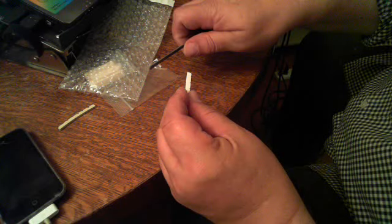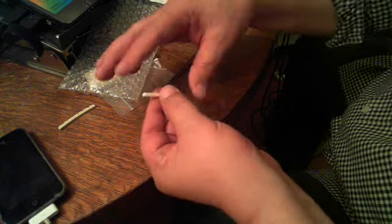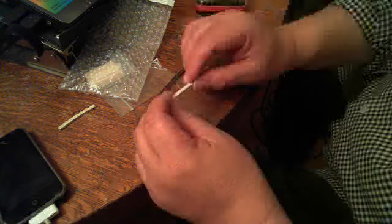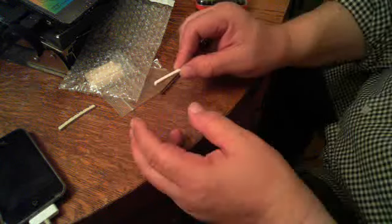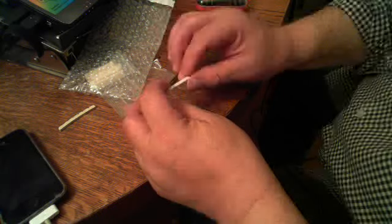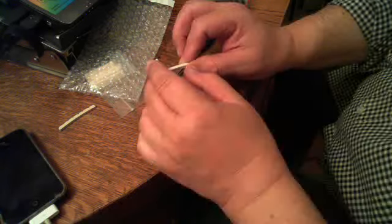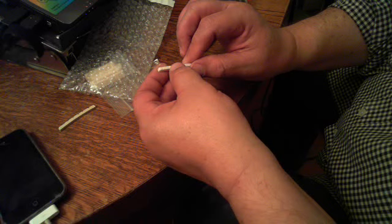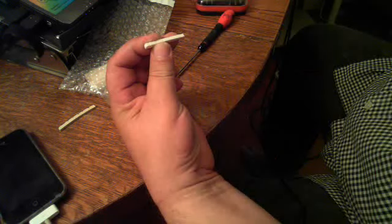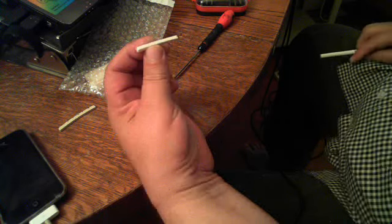Then you'll dry fit it, right? Lift up the strings, put it in there, see if it slips down with just a little bit of pressure, and once it does, take it back out again, put a couple of drops of glue in there, whatever kind of glue you want to use. I use Gorilla Glue, because once it's broken, it doesn't make any difference what it takes to get it out. I just don't want this thing moving. I used a different type of glue before, and it degraded with the polish, came loose and broke. So, a couple drops of Gorilla Glue for me, and this thing will be in there and finished.